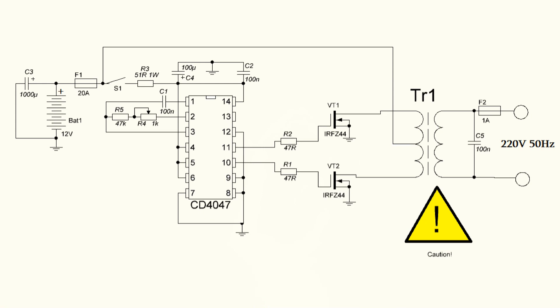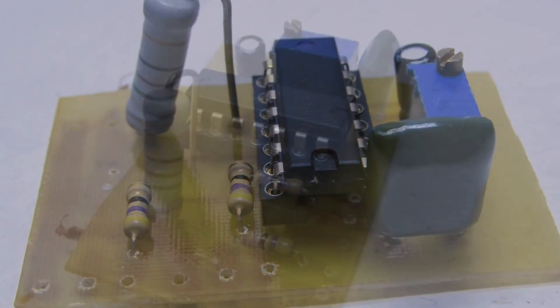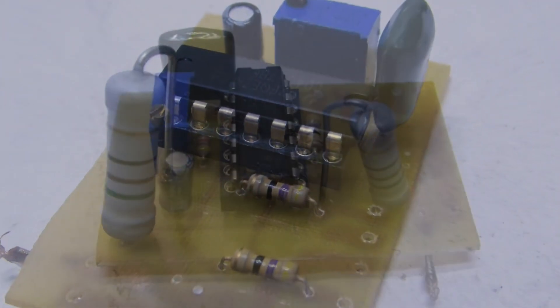The scheme is very simple — I'm sure everyone will be able to do this. The circuit is a push-pull converter. The pulse generator is based on chip CD4047. The same chip monitors the field effect transistors; they operate in switching mode, and at each time only one of them is open. If for some reason both become open, it causes a short circuit and transistors will burn out — it can happen if monitoring is wrong. Although CD4047 is not a specialized chip, the control is quite good.